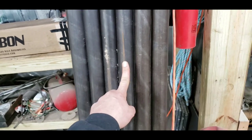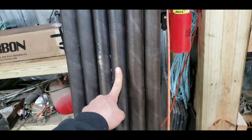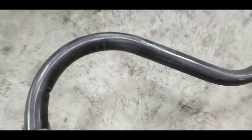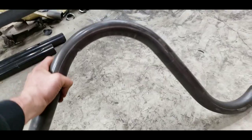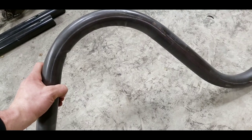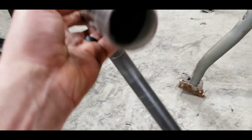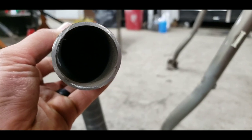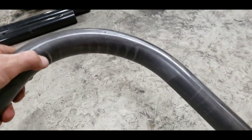This is my old steel DOM — just your basic everyday cold roll DOM — and over here in my scrap pile are some of the bends I did on some chromoly 4130 DOM. It is .095 wall, inch and three quarters, which is a thinner wall than the .120 obviously. That being said, it did a few things I didn't expect.